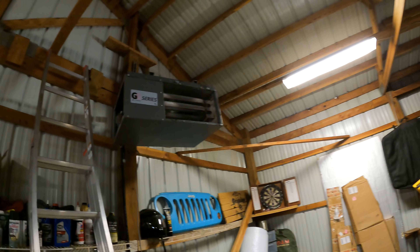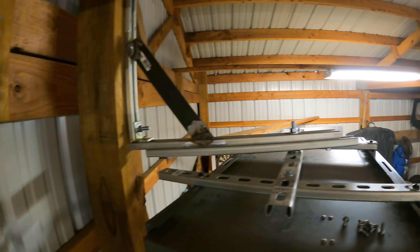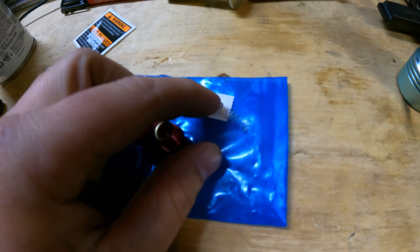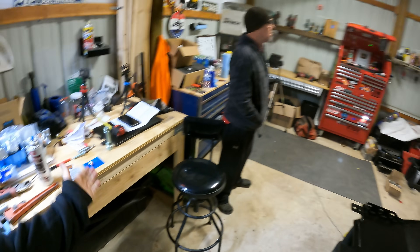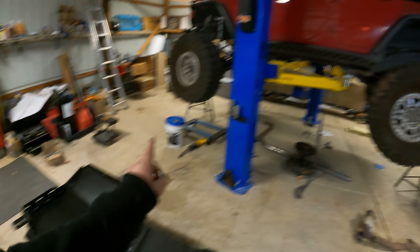In the meantime while Mike was painting, I put up this new propane heater for the shop. For the past few months this diesel heater has been working amazing but it's definitely a temporary solution, and over there we have a space heater. But this heater right here is what will really keep this area warm. This is originally a natural gas heater and we're converting it to propane. The mount is simple - just unistrut, lag bolts to the six-by-six with a little mount up top. It does swivel side to side. I bought a conversion kit for 80 bucks - a new jet and a tiny little regulator spring. We have to YouTube how to adjust the regulator output. We'll let the skid dry, do another coat, then get it up in there and start doing the exhaust modifications.